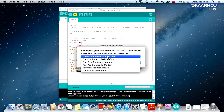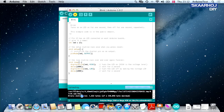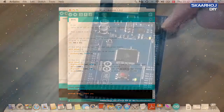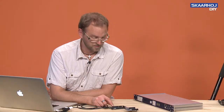It's now going to upload and it gives us the choice between Bluetooth, which we are not using, and then the USB modem down here. So you select USB modem, press OK and it uploads. It's done uploading. Everything is fine, and we can now look at the board and see that the small LED is blinking every second, turning itself on and off.